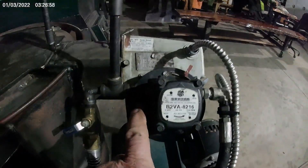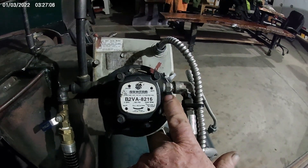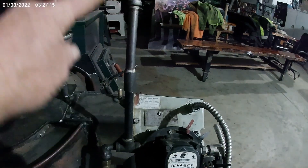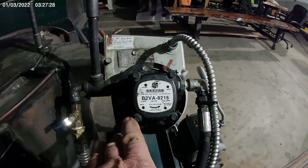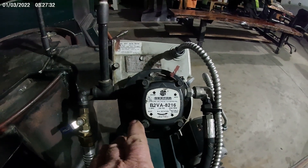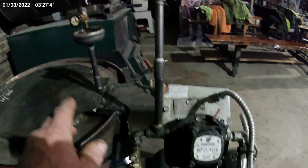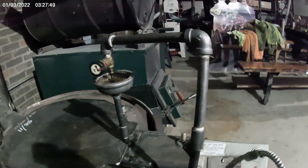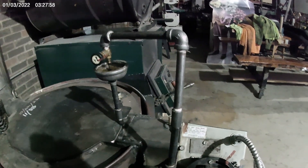If you look at the pump here — both of my lines — I'm not letting the pump run on. It's regulated off right now; I'm just taking and bypassing oil back to the tank. This stem here comes up and goes over, and that's what's dumping into my funnel. We're not pumping high pressure oil here. I've got this little ball valve where I can open and close and bypass oil, and keep my marks lined up here as to where it runs really sweet at. You just got to play with it, but you never want to walk away from it because you walk away and you're going to have a problem.